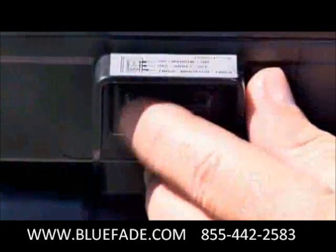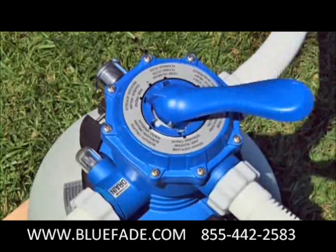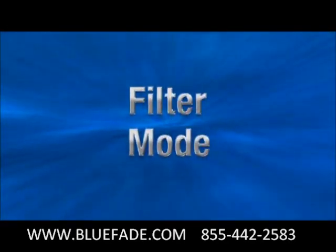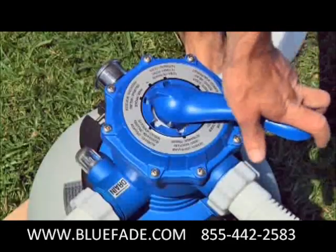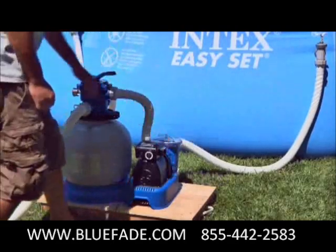Turn the pump off and change the 6-way valve to rinse. Turn on and run the pump for a minute to level out the sand after backwashing. Switch off the pump again and turn the handle to filter. Turn on the pump and let it run until the water is clear.